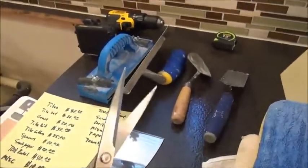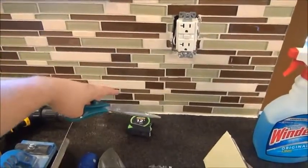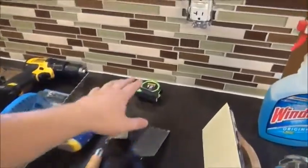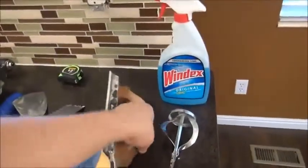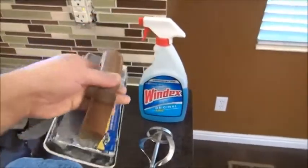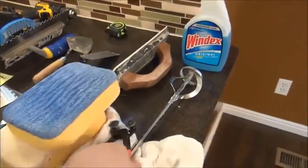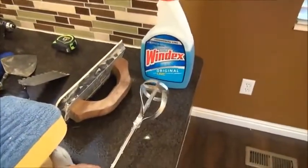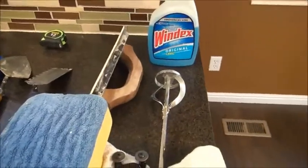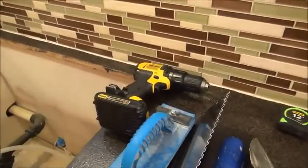You're also going to need some scissors. This tile is on a fabric-type wire backing that you can easily cut with a standard set of scissors. Your tape measure. This piece here is a grout float — once you get ready to put the grout down, you're going to need this float. This here is a tile cutter. And this is a mixer that I use to mix the grout. You can also buy the grout pre-mixed, but it's a lot more expensive, so we bought it, put it in a bucket with some water, and mixed it up with the drill.